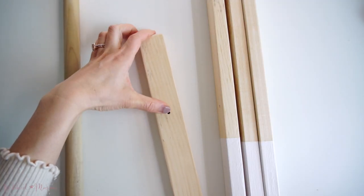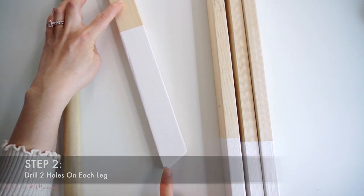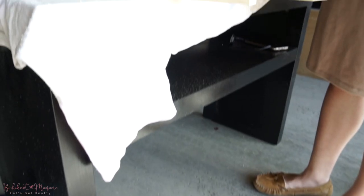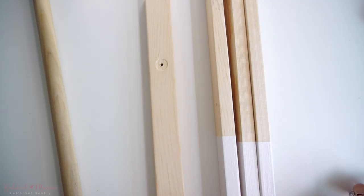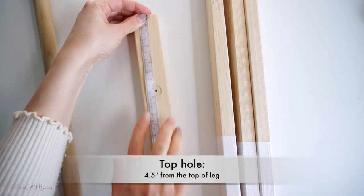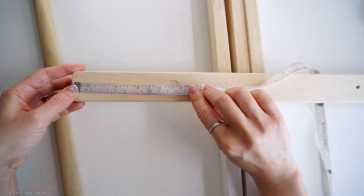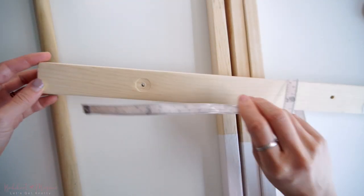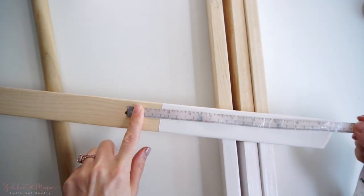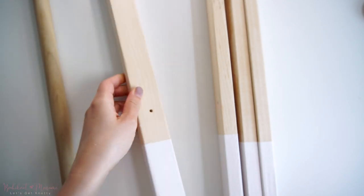Once the angle is cut off, we're now ready to go on to step two, and that's drilling two holes on each of the legs. You will need a drill to be able to drill two holes through each of the legs. For the hole at the top of the leg, it is measured at approximately 4.5 inches from the top. As for the bottom hole, this is measured at approximately 10 inches from the bottom of the leg. You'll need to drill both of these holes on all four of the wooden legs.